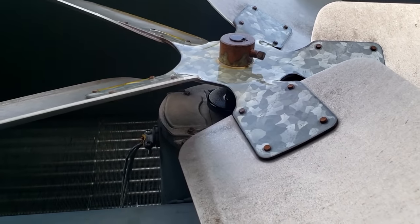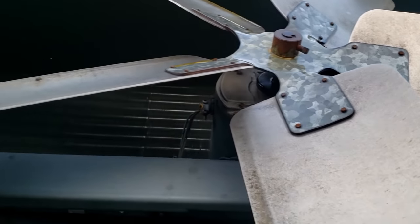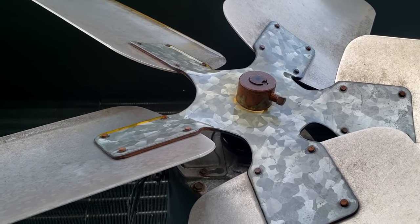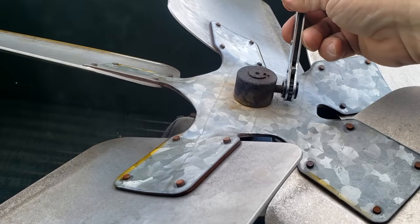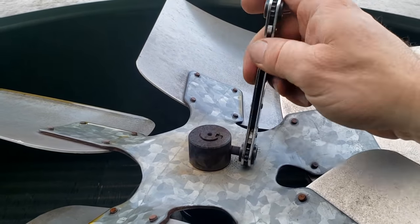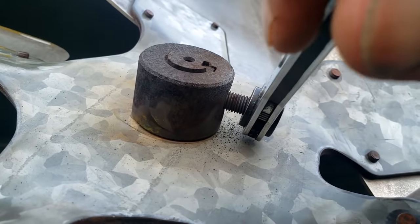When I got to this last one here, the old wrench isn't doing so well — I can see the thread's not turning. So I'm going to try to heat that thing up and see if we can get it out of there. I'm going to cheat and try my hand torch first, which probably won't get it hot enough, and if not I'll have to get the acetylene torch. I didn't think it was going to work, but I just kept on turning, figured we'll see what happens — and sure enough she broke loose. Now I'll probably go ahead and stick just a regular bolt or whatever I can get in there, because you can see those threads — if you get close enough — turn funny as you're turning it.